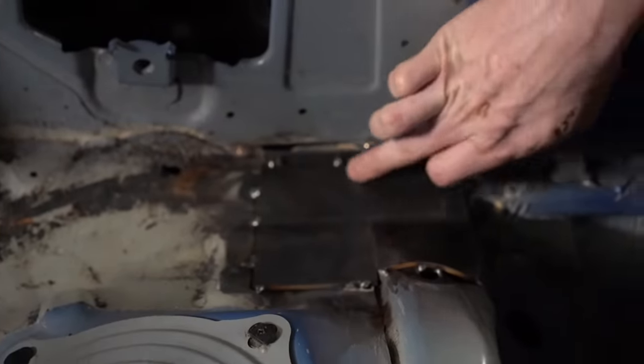Okay, so now you just saw us cut all the tacks for the cage and slide it forward, drop it down off of its boxes. This is what you're left with, a cage that's 4 to 5 inches away from the roof with nice exposed areas of the tube where you need to finish welding. What we did was weld as much as we could with the whole cage up with all the tacks. And now that we have this up like this, it's an easy process to just finish off the tops of the welds here and then on top of the main hoop at the back.